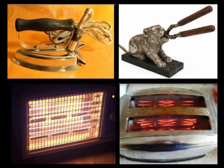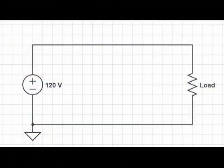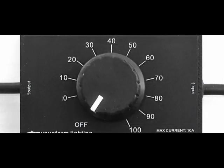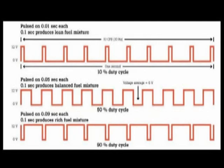These examples represent the use of a standard household current like 120 or 240 AC voltage passed through a closed loop element made of a resistive material or alloy. The amount of resistance and the current being applied will determine the maximum amount of heat available. The temperature can be controlled by adjusting the line voltage or cycling the current to maintain a desired temperature.